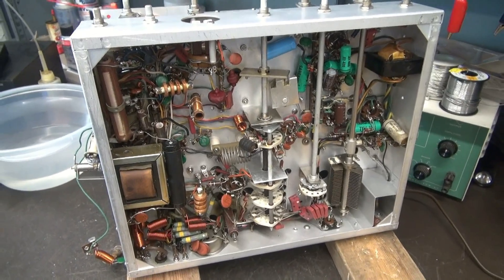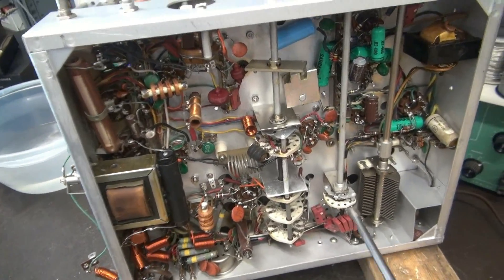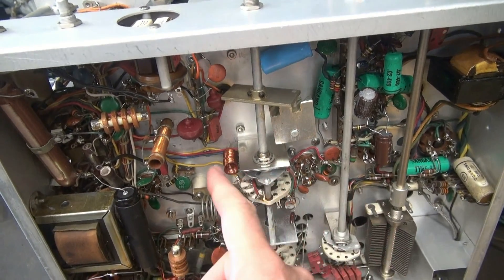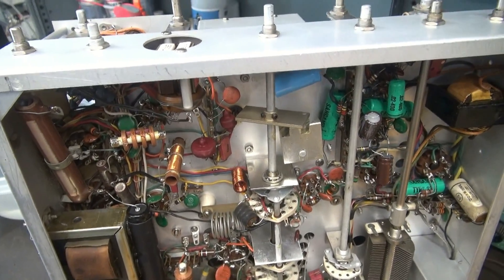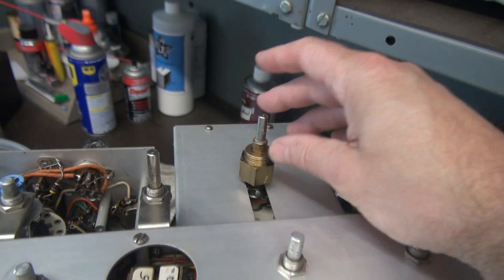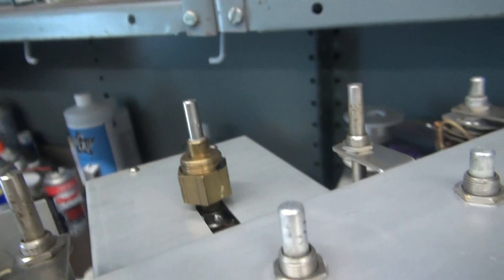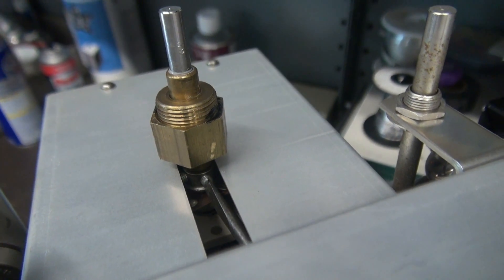As before, you tip the Ranger up on his back. This will allow you easy access to those mounting nuts so you can get in there. Of course, a lot of them are buried and kind of difficult to get to, so you have to be patient. After I get that installed, the Vernier is going to go back where it was. What's really cool is Johnson gave you this convenient hole to get your screwdriver up to that Vernier to tighten it in place.